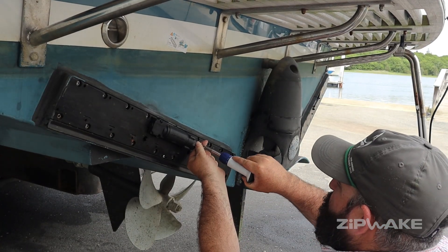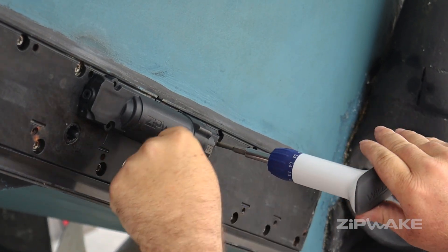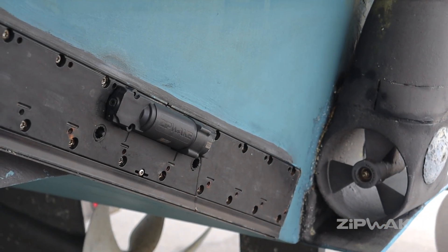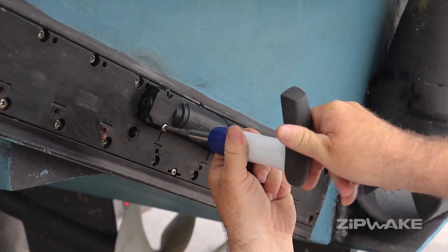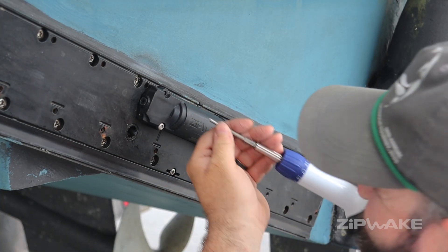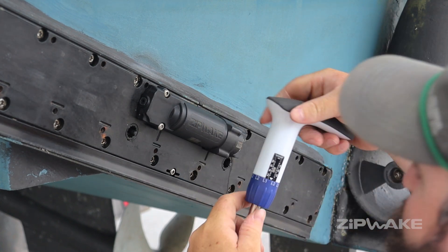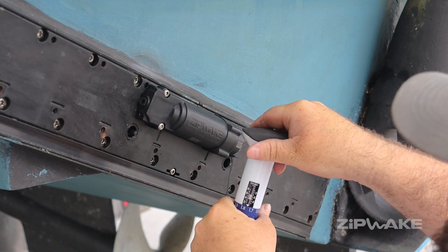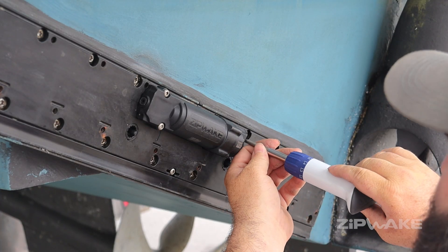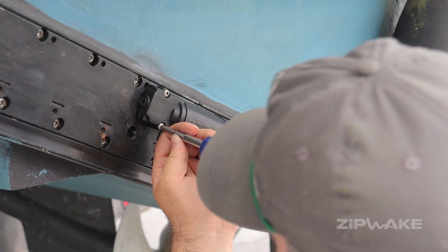We're going to put our three servo screws in. I like to slowly bring these down and seat them on the shoulder of the servo — just nice and gently. I go to the right one first, then come back and do the two left ones. As we tighten down, we just want to hold it snug to the back plate, make sure it's seating properly and evenly balanced. The wrench is set to five newton meters for the front plate, so drop it down to two newton meters for the servo — rotate it down to two, come back in, and fasten them down until it clicks. Do that for all three fasteners and you're good to go.